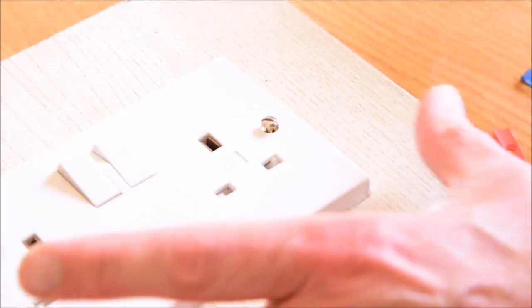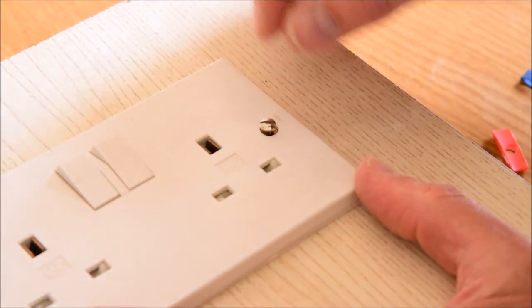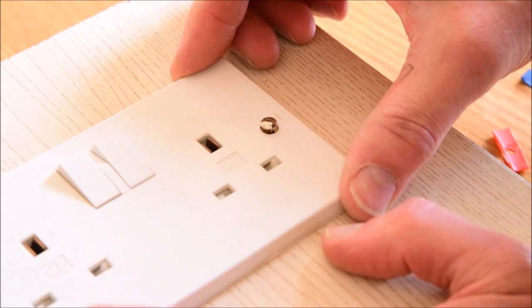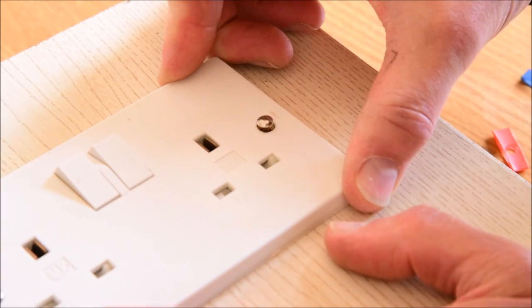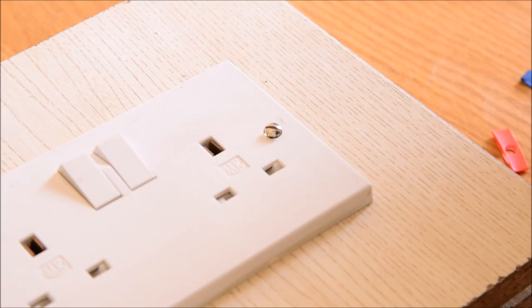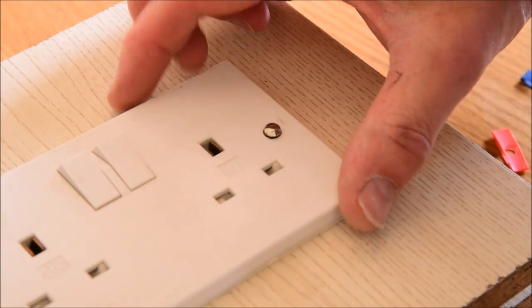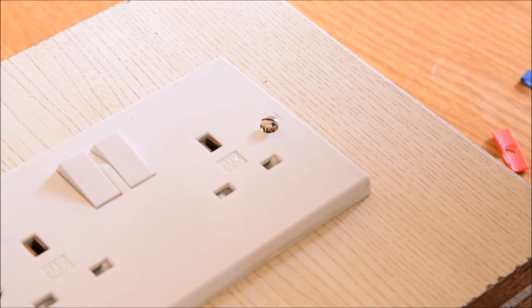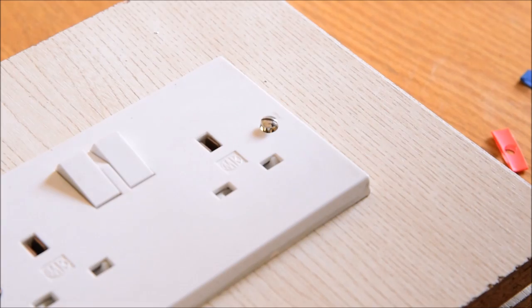So even though the lug isn't moving, the backbox saver is able to slide up and down behind our existing fixed lug, and we've now got a considerable amount of adjustment play so that we can raise, tilt, lower, so that this socket is completely level and that it lines up with maybe one that's adjacent to it. That's the secondary use of the backbox saver.